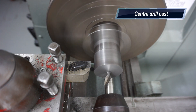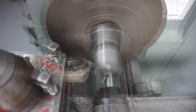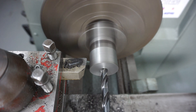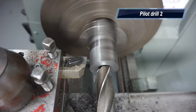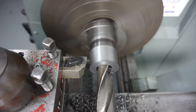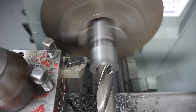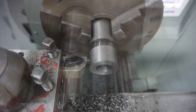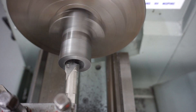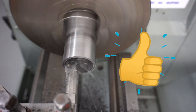I could then centre drill it, and what I had to do here was drill out and bore out the centre piece to match the inside diameter of the ring. You can see I'm just following up with different sized drill bits, enlarging the hole one step at a time, and then coming in with my boring bar to bore that internal diameter. I was getting a little bit of squeal out of that — I touched it just to see if I could take that resonance out of it — and eventually it went away when I just took a bigger cut.